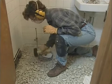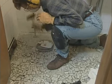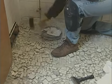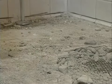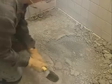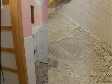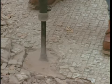You have a couple options for trying to take out old floor tile. The simplest is to beat on it with a fist maul or a sledgehammer. You want to break the tile and bust apart the layer of mortar that you'll find lots of times under professionally installed tile floors. And the mortar will probably have a wire mesh in it for reinforcement. Another option is to rent an electric jackhammer to chisel away at the tile and mortar.